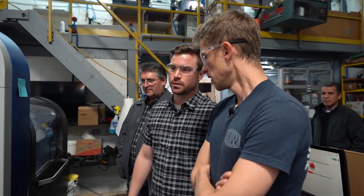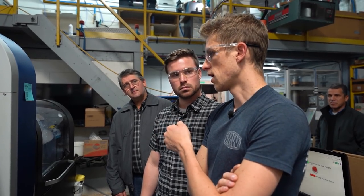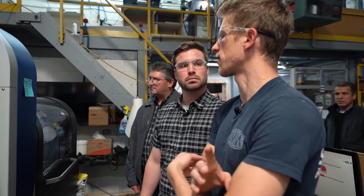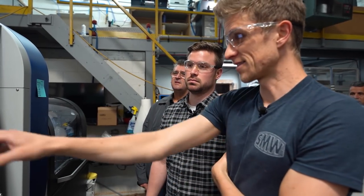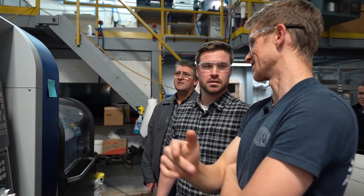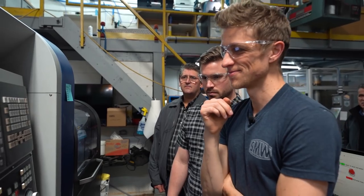And yeah, exactly. But when I'm making parts, when it's running good, and it's warm and happy, I'll check it every hour. Okay. And then be like, one-tenth. Right. And it's got five digits. Oh. And it listens to the last one. Wow. So if you give it a half tenth offset, it listens. It makes your part half a tenth bigger. That's great. Yeah, so it's cool.